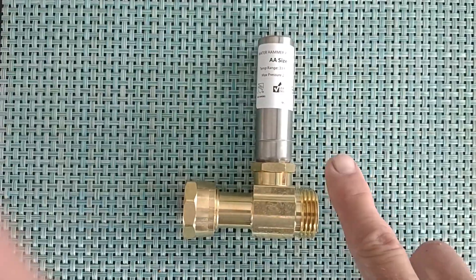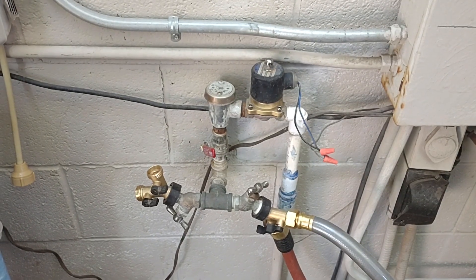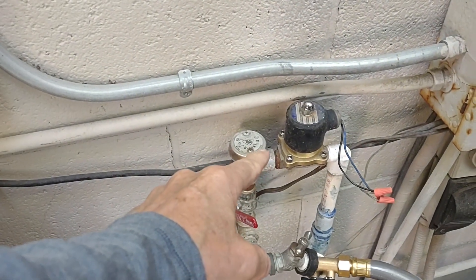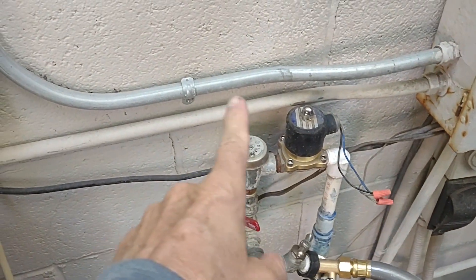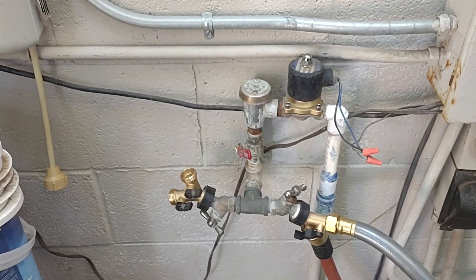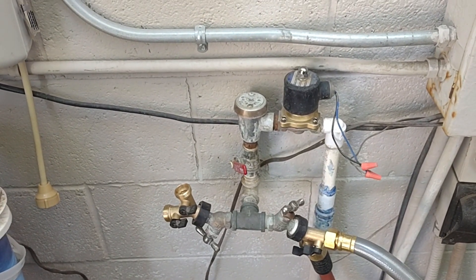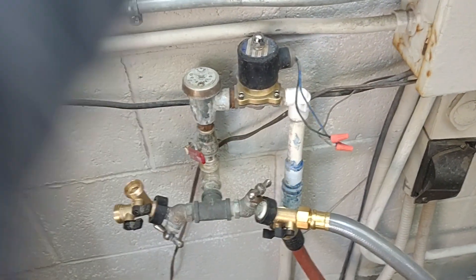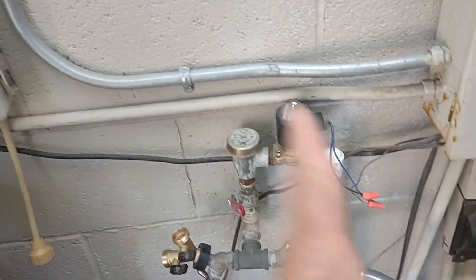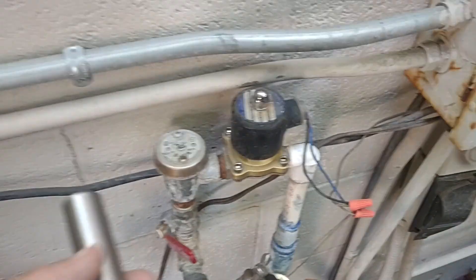Here's the culprit and the area for the possible fix. This is what's causing the water hammer — it's a solenoid in line with my pool filler. When this kicks on and off, it causes a pretty sizable bang that's quite audible inside our kitchen, which is right on the other side of this wall. What happens is the water is moving through this pipe at a pretty good pace, and when it shuts off, it throws a roadblock. The water essentially piles up, creates a pressure wave that transmits up and down through the pipes.